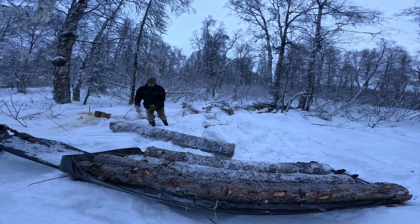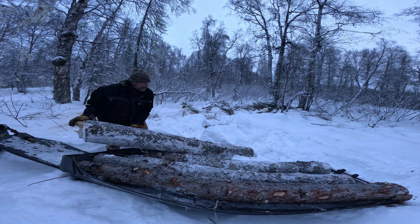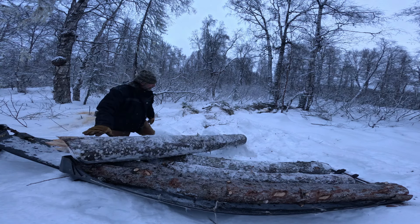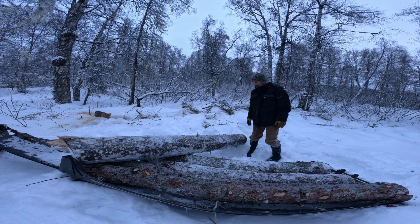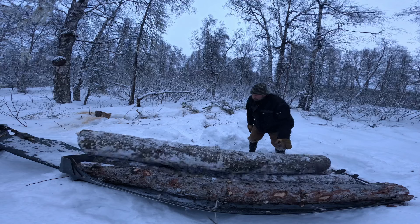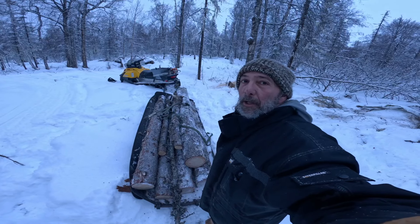Another big thing is to make sure that you take care of your chimney — make sure you sweep it on a regular basis, at least once a year. In my case, because I'm crazy, I tend to do it monthly. I don't get a lot out but I always know that my chimney is fine and I'm not going to have another risk of fire after that last one. Anyway, let's get back to the show.